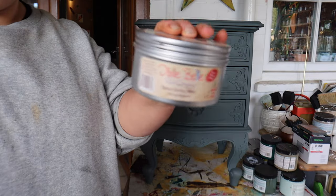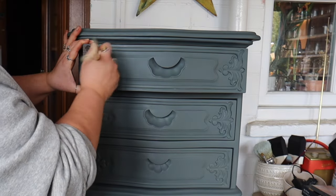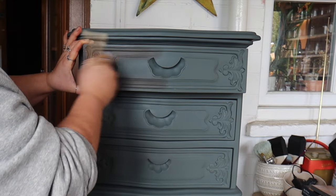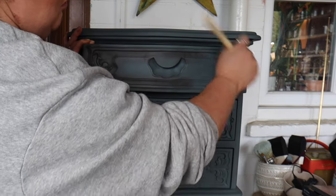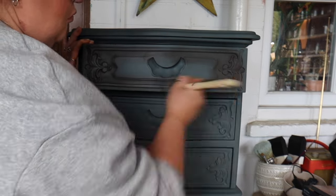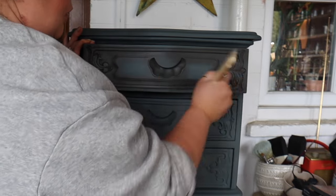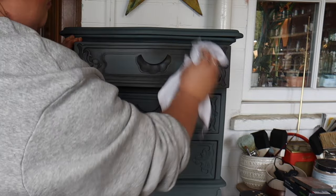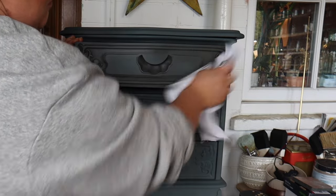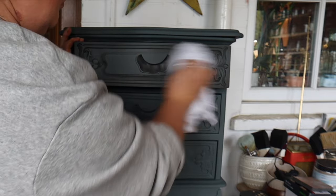Because I had a pretty pattern on the front of this piece I wanted to add a little bit of dimension. So I'm using Beeswax Waxing Brown for shading. I'm going to apply it with a French tip brush just in the areas that I want to push back and add a darker shaded area to. I'm applying it quite liberally and then with a rag I'm just going to remove the excess, which will leave the wax sitting in all of the recessed carved-out areas.